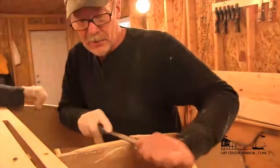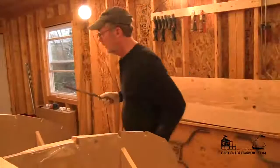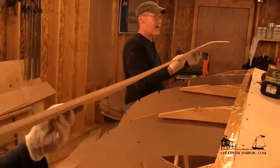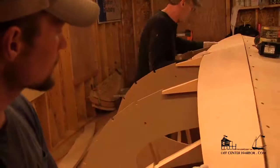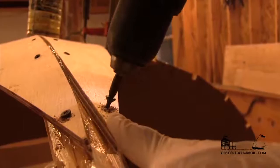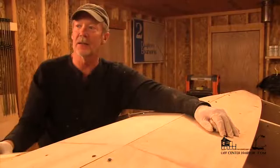This is just squaring out the corners where I trimmed the angle. That takes care of our corrections for the starboard garboard. Keep it off the boat until I say so — right there, into the notches and down, and we'll clamp from station four. This has been a really good and big day because we have started planking the boat and have garboards on both sides. That makes me sleep well because the planks fit well, the molds behaved well, and everything's going to be good for planking up the next six planks. It's a really good feeling to be at this point in the project.